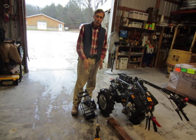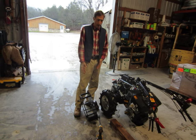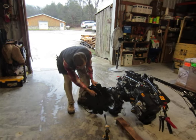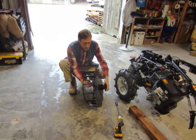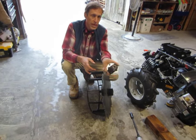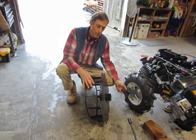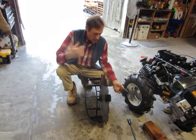So they designed the Superbite Outriggers to be easily removed from the tractor once you've got the system installed. There's a big crank on the inside connected to a bolt, and that bolt is screwed down into a nut which is welded onto this receiver piece. This receiver piece attaches to the tractor hub, and when you want the outrigger on there you just spin it on with the big spinning nut, or spin it off.